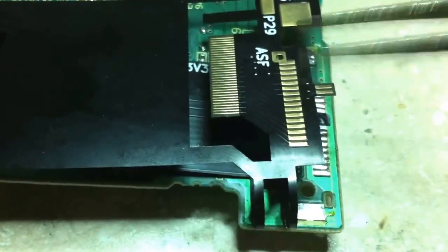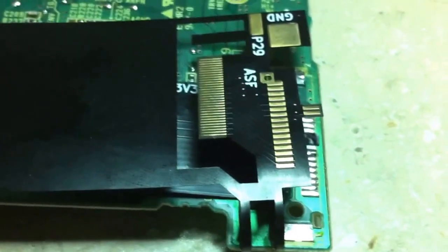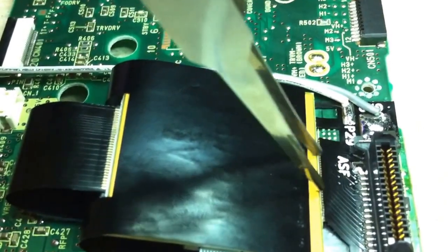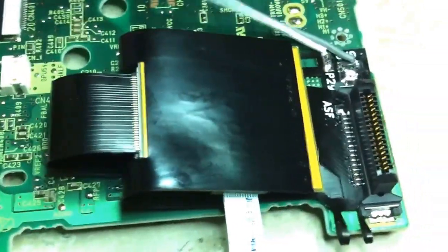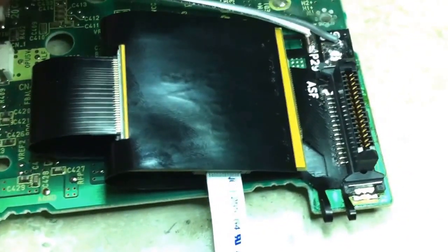My next step in this process is to put that connector on and get it all soldered up. Current progress: I have installed the DVD drive connector and installed the WASP Fusion. This part plugs into the host side, this part wraps around into the DVD side. The WASP Fusion is actually going to be sandwiched in between both layers, which will provide electrical isolation to prevent any type of shorts.